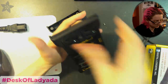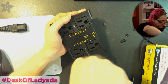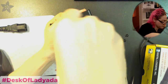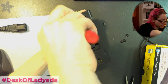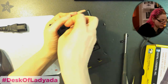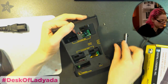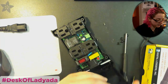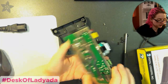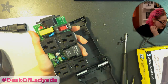And this is mounted from this side. And I really prefer these sorts of enclosed relay outlets. Not only because of the mains power, but a lot of people when they're doing mains stuff, it's not unusual for them to have water in the area, or dirt, or maybe it's somewhat exposed to the elements. So anything that protects your wiring is good.